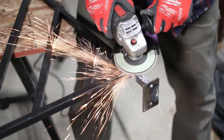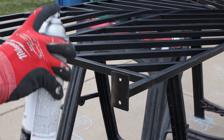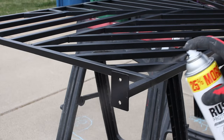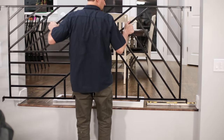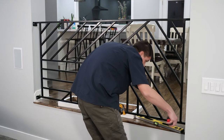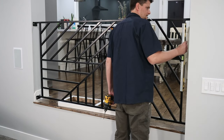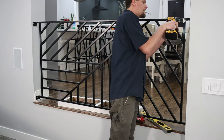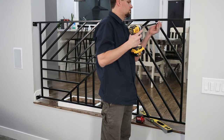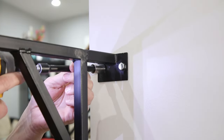The couple of months this was installed prior to our addition, the top railing was actually attached to the wall with these wood block things and I did not like it one bit. So when I put it back up, you can see that I went directly to the wall on the top with the metal bracket, and I did include space for the baseboards on the bottom. I took the measurements accordingly and everything worked out perfect — I didn't have to hammer this sucker in, it fit like a glove, except for that little spot that needs some touch-up paint.